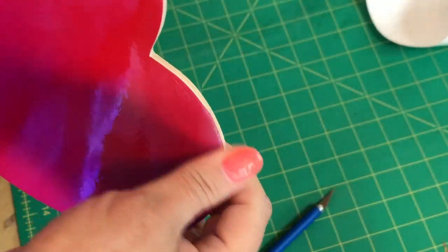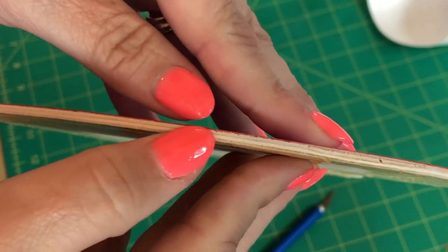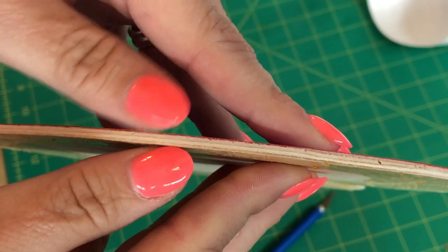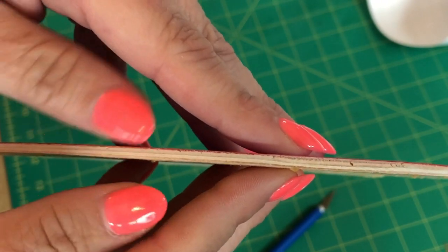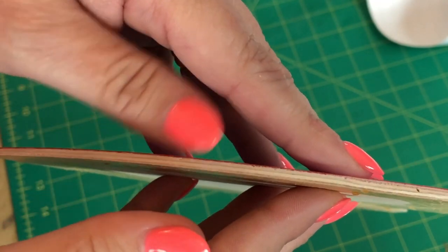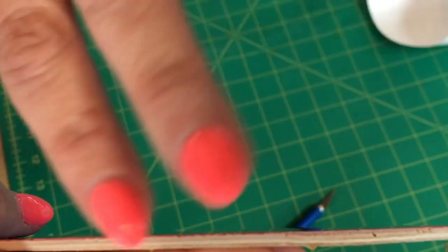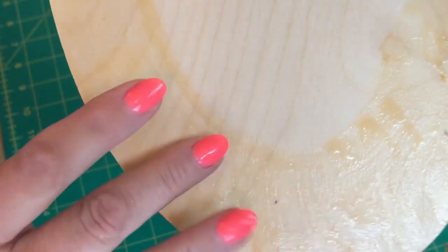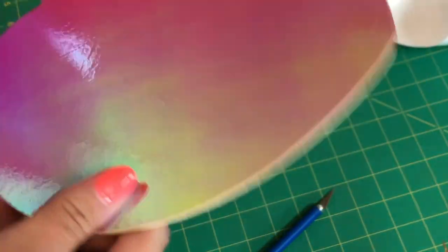Since I'm going to be covering a lot of this with resin, even the little bubbles will probably disappear. Also, because the wood is a certain thickness, the film is on the top and there's a possibility of it coming up on the edges. When I apply the resin, I'm going to make sure I go over the edge so it bonds both the top and the edge. This is my liquid latex — there's another video on how it helps with cleanup and drips. I use this stuff on a regular basis.